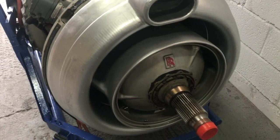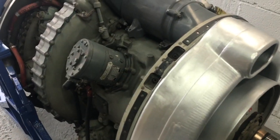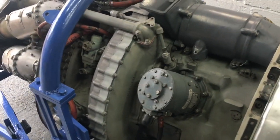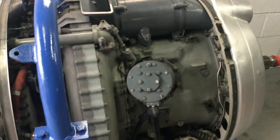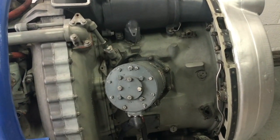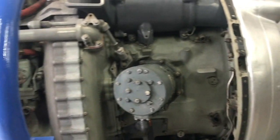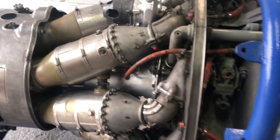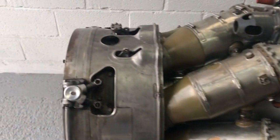It's quite a powerful engine. It's got about 1,800 shaft horsepower and it's very light — only weighs just over 500 kilos. The front end has got two centrifugal compressors inside there. It's basically a massive turbo with a shaft that runs right down the middle, flame cans around the outside, and then a three-stage turbine at the back.